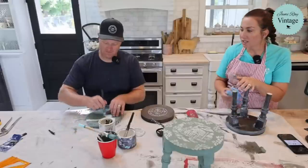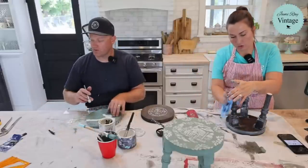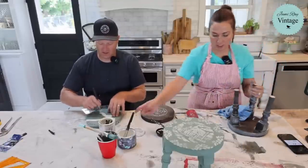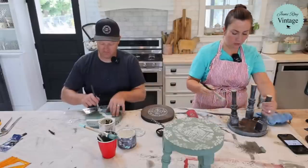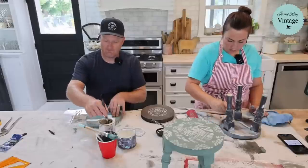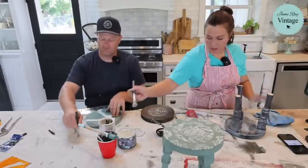Well, how do we attach these? We used dowel screws. Yep. They're a quarter inch by 1.5 inch. They've got pointy, screwy ends on two sides. So you put one side in your leg and one side in your piece. Earlier in the video, I showed them up close. I could show them again. If you watch the replay, you can see how they go together. I'll show you guys this up close here in a minute.